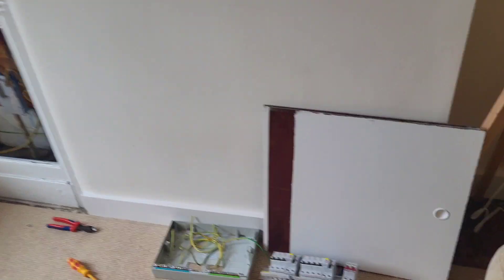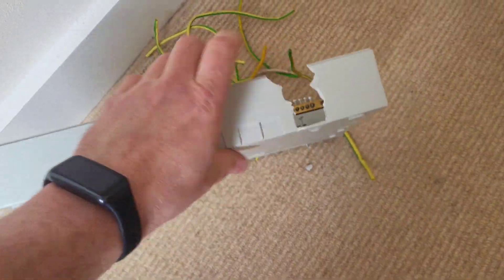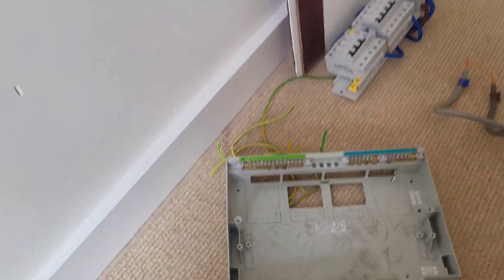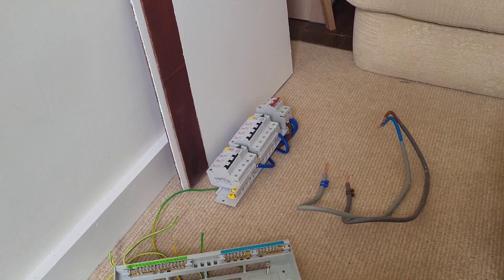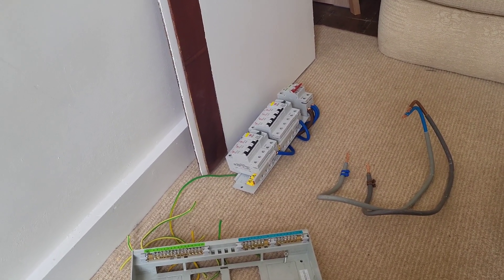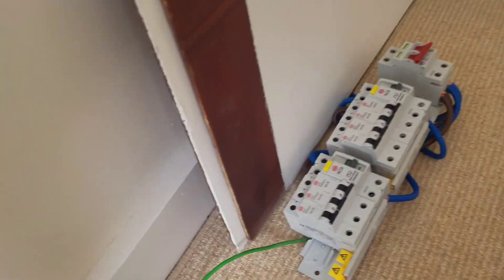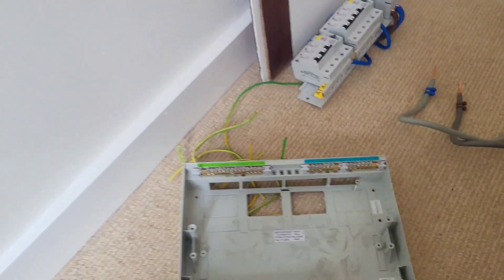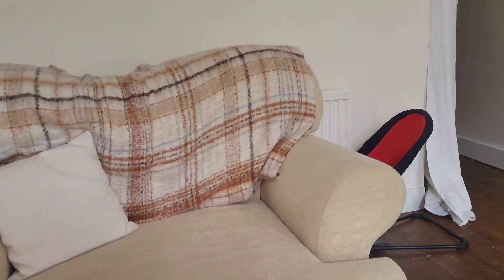This was the said board — it was basically just sat on the back there and you could get your fingers and hands right into it. Really poor. Another thing is the type of AC RCDs — there's loads of pulsating DC current in the property, surging and stuff, so it just points directly to a board upgrade. There's no signs of thermal damage but it's just absolutely shot.